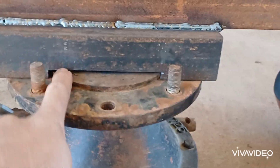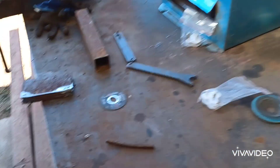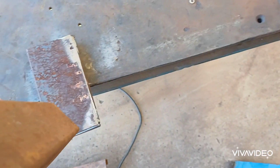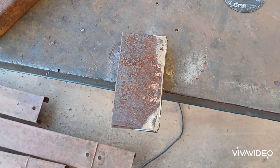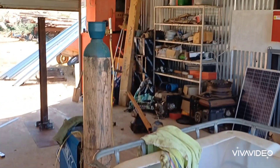So I've cut out that piece and it fits in perfectly. Now I'm going to weld that piece of steel here — this is for the tilting, the north-south axis. This is basically the west-east axis. I'm going to weld these four pieces of steel together, just stack them, then make a template — cut it out into the steel, drill a hole right through all of them, grind them apart again, and then weld two pieces on each side.